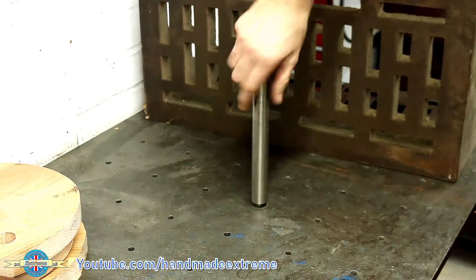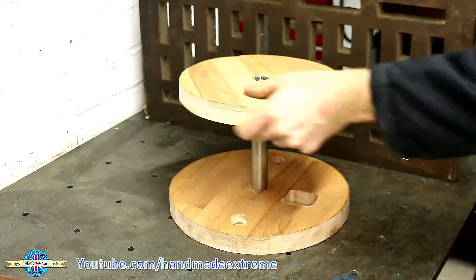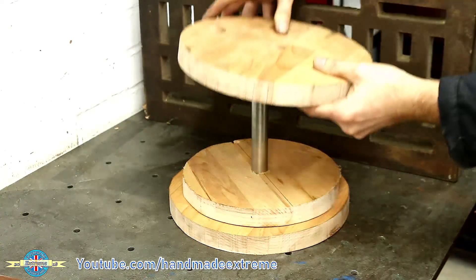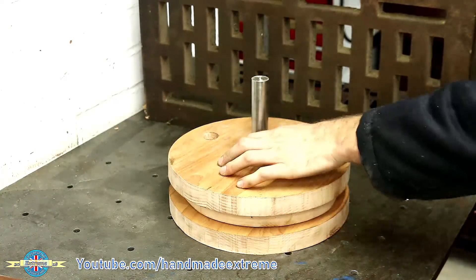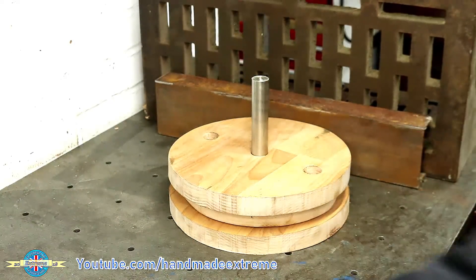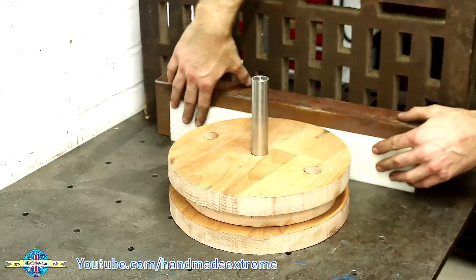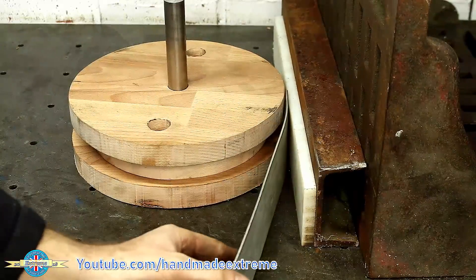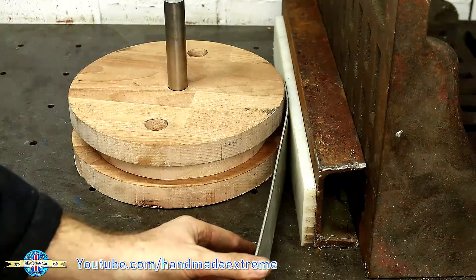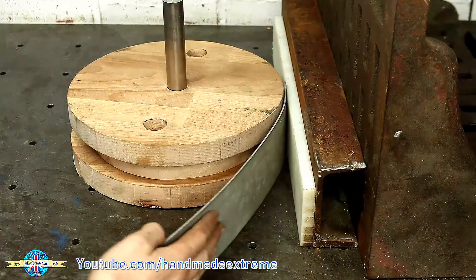When I built the welding table I welded some nuts on the bottom so I could screw clamps and things down to it. I then put some wooden formers cut from some glulam worktop, and then the angle plate is going to be the stop. I've got a bit of channel and some plastic to stop things getting scratched.